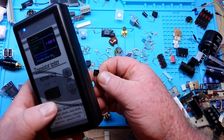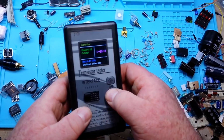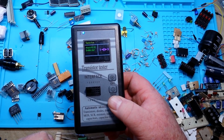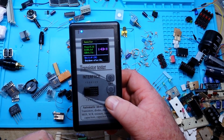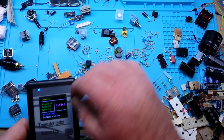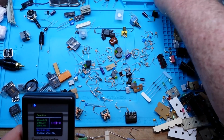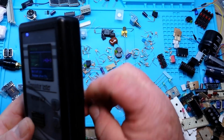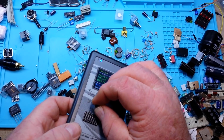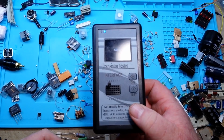KS looks like 19774L5. I'm assuming that's also a capacitor. Yeah, 496.5 picofarad. So we got lots and lots of those. Only looks like we got one 3-terminal job here. I think most of the weight of this package was in those large connectors.